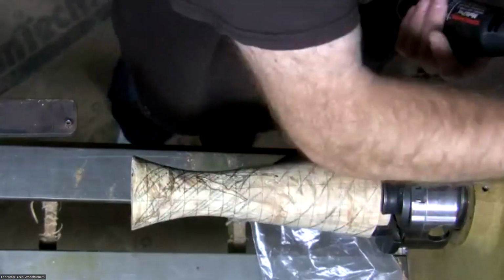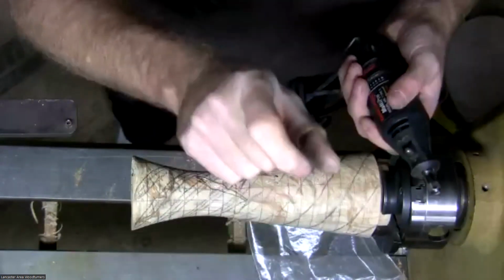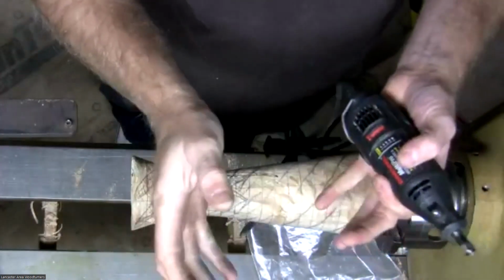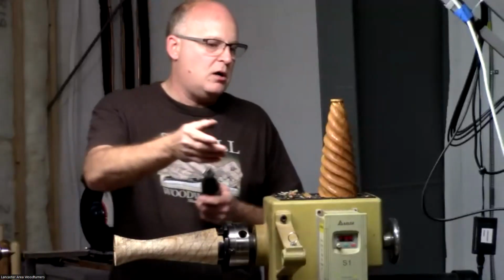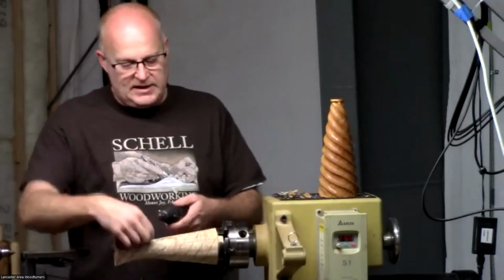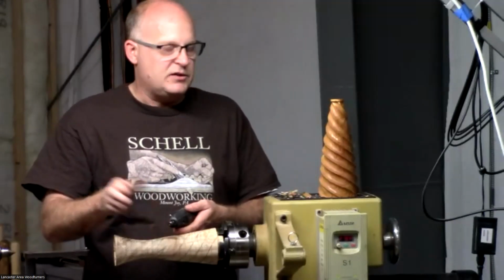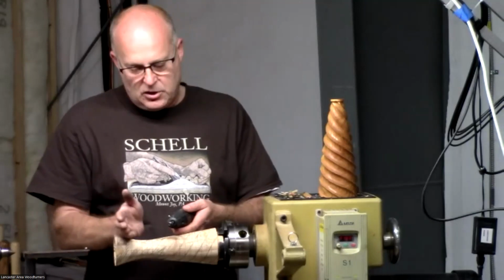When I'm doing an open piece, I might do a little bit of the open pieces in bits and pieces because I want to test the wood to see how strong the wood is. I don't want to carve a whole piece and then find out that when I go to carve the next piece next to it, the wood between it's going to snap. So I'll test it and just do the opening across the tops,